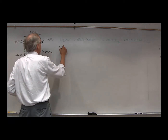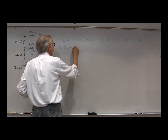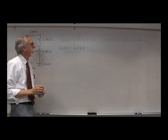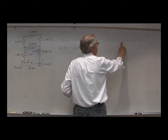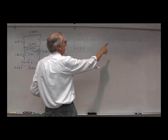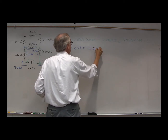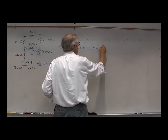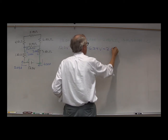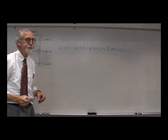We have 12 volts, minus 1 times 2.08, so that's minus 2.08 ohms times amps, that's a volt. Let's come over here, minus 3 ohms times 2.08. 3 times 2.08 is what? 6.24. Minus 6.24 ohms times amps, volts, minus 2 ohms times I2, and all of that must equal 0.